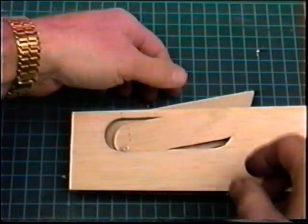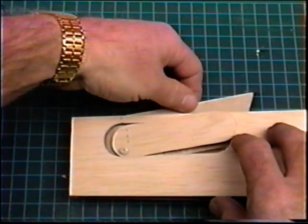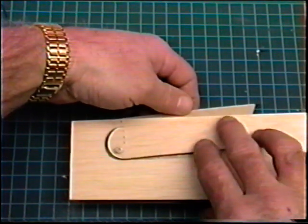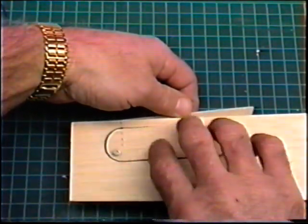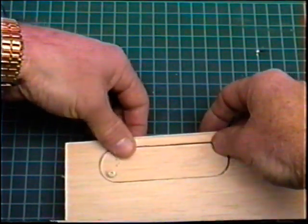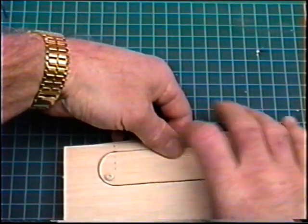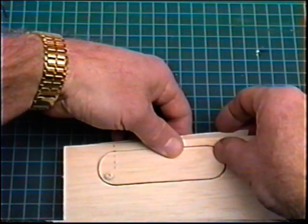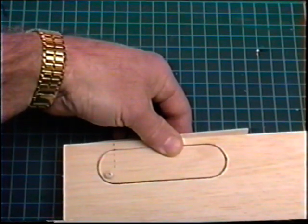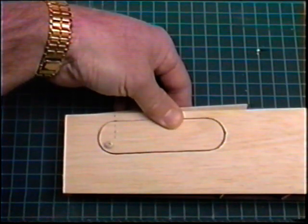Now here's a tip you may be able to use in a lot of other ways. What I always try to do, and it's kind of machine shop procedure, is to have something to get this lined up just right. Because I don't want to get all done and then have the bolt not line up. So what I try to do is bolt the two pieces together. Just get these test fit in place. Then I can tack one drop of glue on it. Now see, I can move the hole and get equal clearance around everything before I tack glue this. And that bolt is holding it in place. It's giving me the full alignment here without a lot of extra work, without a lot of extra fooling around.